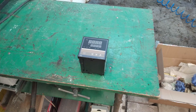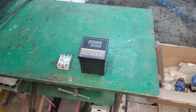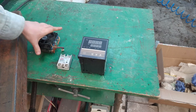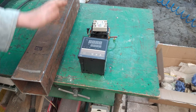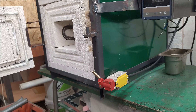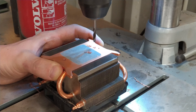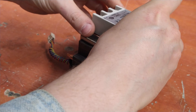The next thing is the electric installation. We have a PID controller with the thermocouple, an SSR relay, the heater, and the limit switch. Don't even try to make an oven without it. Inside the heater flows a very high current — in my case it is almost 10 amps — and it won't just kick you, it will definitely kill you. The most important thing for your safety is to make a kill switch on the heater which breaks the electric circuit if the door is opened. Really, it's not a joke.